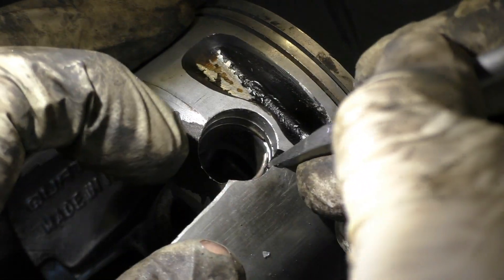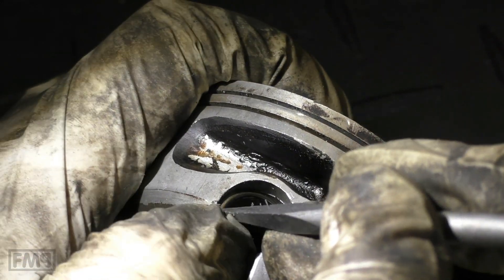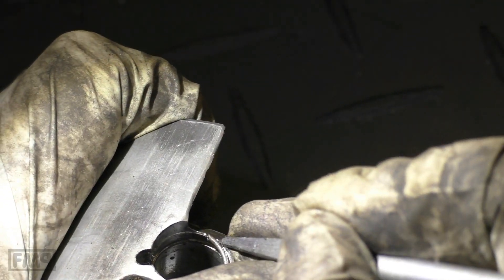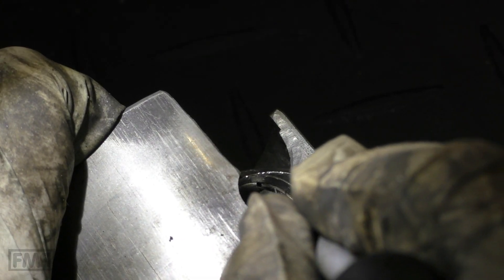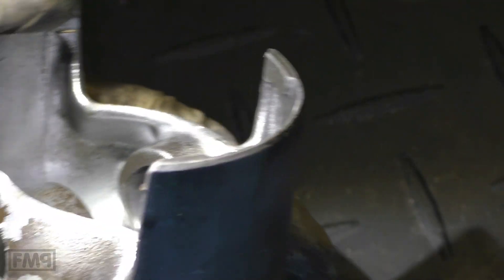Let's take the other side out and reapply it to see how tight it sits even after being removed once. Check, check, check — now it sits correctly with the opening to the bottom. And even though it's been reapplied, how tight does it sit? It's slightly movable, but it sits very, very tight. Rule of thumb: the circlip sits tight, and that's what I've experienced all these years — never had a loose one.